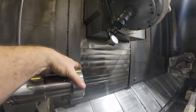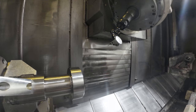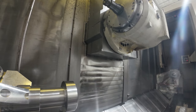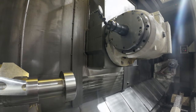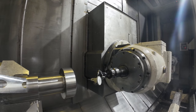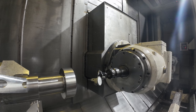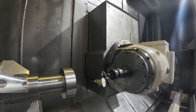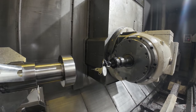I'm going to run the B-axis to zero and physically jog the machine down to XY zero, looking at the display here on the control. I like the Mazak because it actually shows the location of the spindle when you're doing things like this. On some controls you have to call some kind of an offset or something and physically in MDI move the machine to a zero point. But on the Mazak it shows it on the display — it shows the tool location at all times. I'm going to unclamp the spindle so I can rotate it.